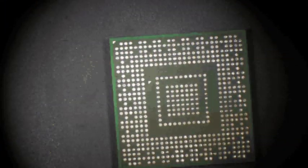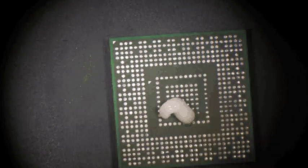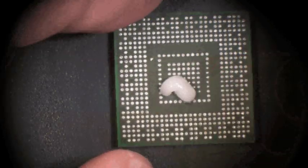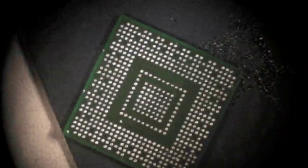Next, apply a small amount of solder paste into the center — just a little dab will do, you don't need to go nuts on it. Then with your finger, wipe it onto the BGA as a thin film. Just a thin little film is all you need. Make sure you get all the BGA sites, but don't go overboard because whatever excess there is, you've got to clean that back off too.